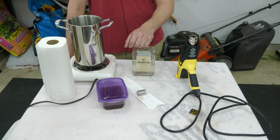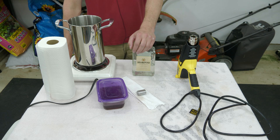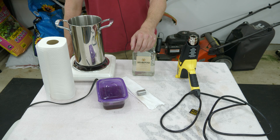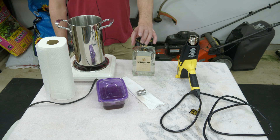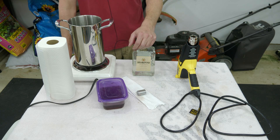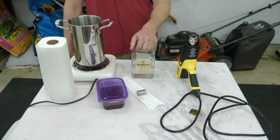I've used this process several times on various projects, but it was more aggressive than I wanted — the chemical reaction more so. I think I got a little more pitting than I wanted on parts. Since then, I've been playing with the formulation, dialing it back to make the chemical reaction less aggressive while still yielding a really nice black oxide finish.